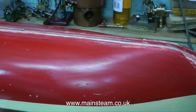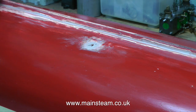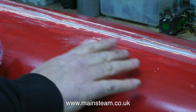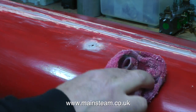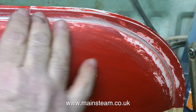When I'm doing a job like this I tend to get car body filler where I don't want it, like on the hull, but it's not a problem — it easily wipes off. Whilst it's still in a flexible liquid state it comes off with a little cellulose thinners, also known as lacquer thinners, but its use needs to be kept to a minimum because it may remove the paint. Here I'm also cleaning up around the water inlet hole in the bottom of the hull; thankfully the paint is remaining firmly stuck as it's very old and dry.